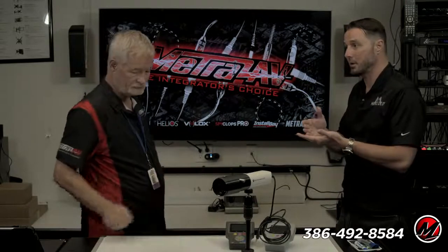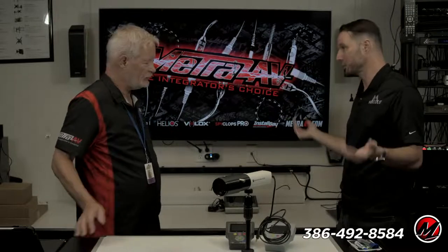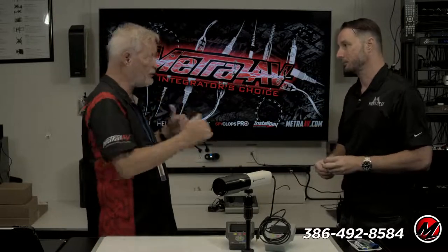So that's really the big difference between standard dynamic range and high dynamic range, is we have just so much more of a container to fit the content in. So in HDR10 Plus and Dolby Vision, these guys can go through, not necessarily scene by scene, they can go frame by frame. And they can literally adjust that movie every frame, however they want to do it. And that's what's really cool. It's like giving the artist a giant box of crayons versus a small box of crayons. The more control they have over it, the more creative they can get. And the movie's done after the fact, frame by frame, versus live broadcast HLG.